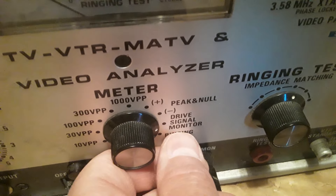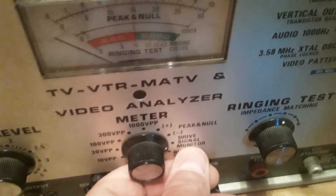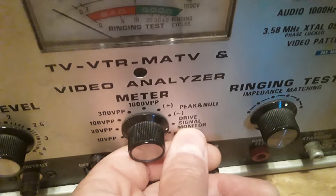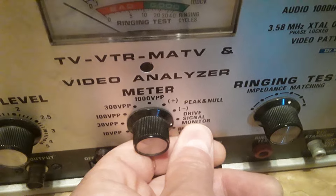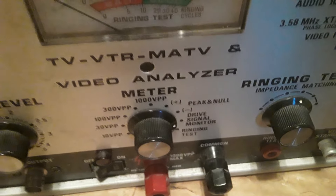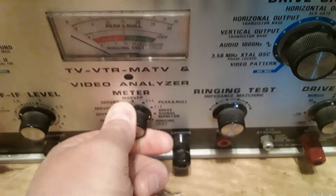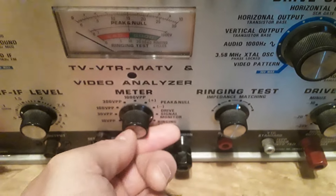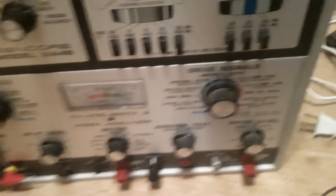I'm just leaving this on — I don't need it for ring testing, I've got ring testers. I was using a ring tester on checking my spark plug modules on my car when it was running real rough. I figured it out, but I had to compare — it has three modules for a six-cylinder Chevy Impala. I think it's called a wasted spark system, so it sparks from plug to plug with no center tap — both ends spark at the same time to complete the connection. I've got two Ico ring testers and another brand, plus the one in the B&K 314.